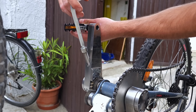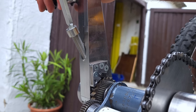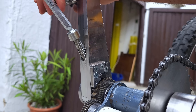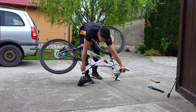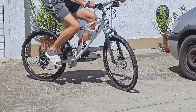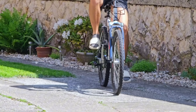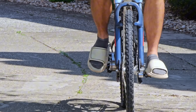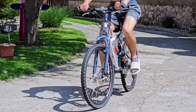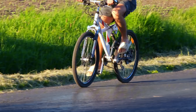It's possible to adjust the spring tension with the screw, which allows the torque to be controlled. As for the forces involved, even though it's just a bicycle, there are still enormous forces at play, which is why components of such thickness had to be chosen. And it really works. The downshifting happens instantly as soon as I apply more force to the pedal. The best part is that it all operates purely on mechanical principles. That's what makes it so special.